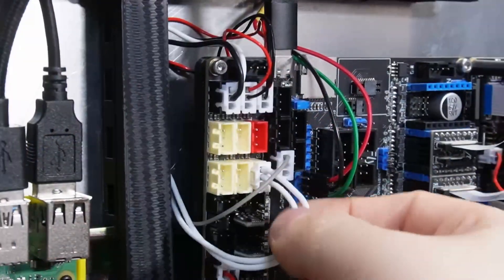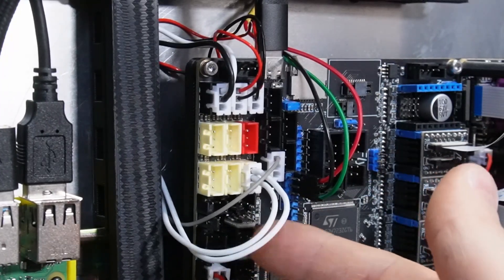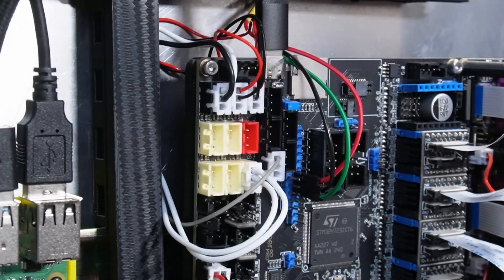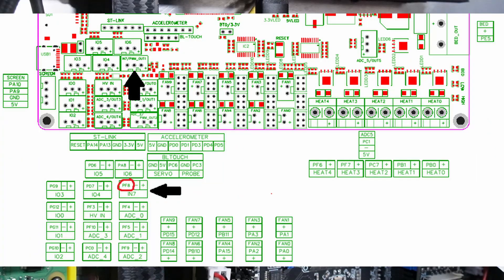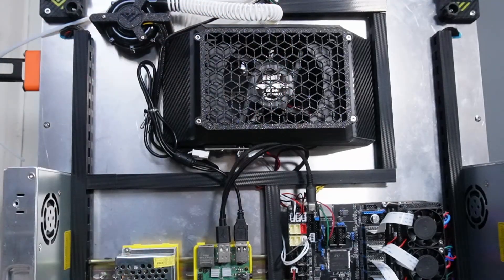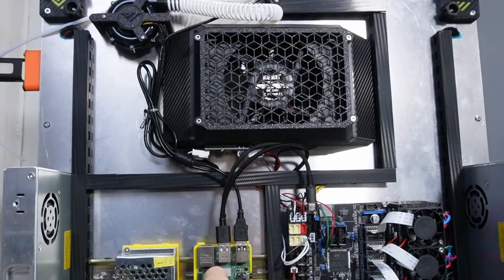This connection is also the thermistor for your hotend. The Goliath uses a PT1000 which comes through here. Next to that is the CPAP connection — you only need one cable to your CPAP going onto the board. I'll put a picture on screen so you can see which cable to use. The CPAP is installed through this side and the CPAP hose goes inside the printer.